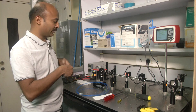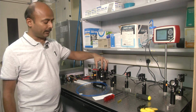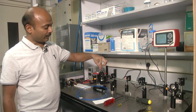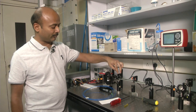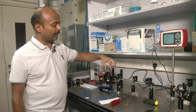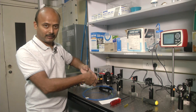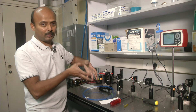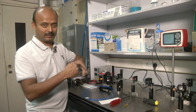I am going to talk about the emission path now, so I will turn off this laser. Here we are going to place a fluorescein solution — fluorescence elicited by the blue light focusing through this lens — and we are going to build a small spectrometer in this part, to show that you can actually see this emission and understand how the spectrometer works. We will see that right now.